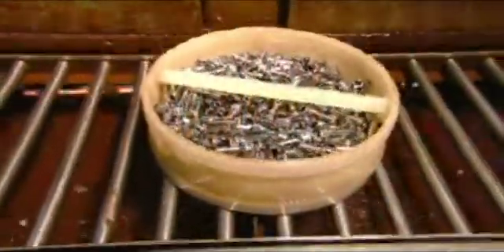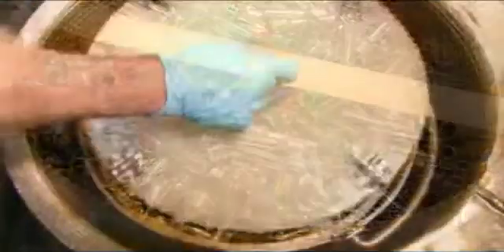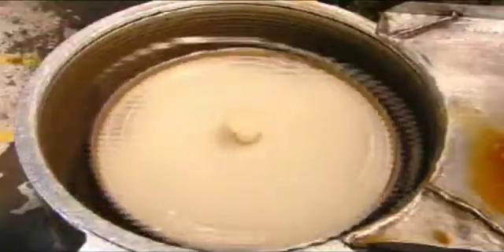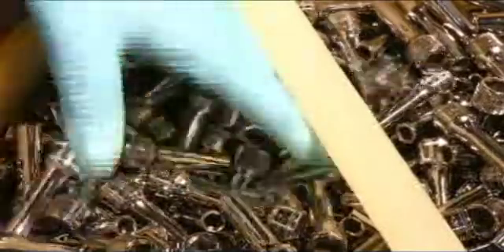The parts then receive a thorough wash and rinse, which prepares them for chrome plating. Now freshly chromed, the sockets look way too nice to be immersed in this brownish stuff — but it's actually a rust-proofing solution to protect them from corrosion. They lock the tub of sockets in a centrifuge machine, which spins the parts to remove excess rust-proofing liquid. And now these sockets are ready to shine on the job.